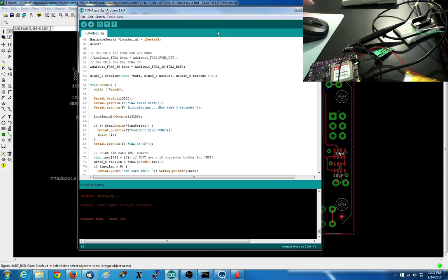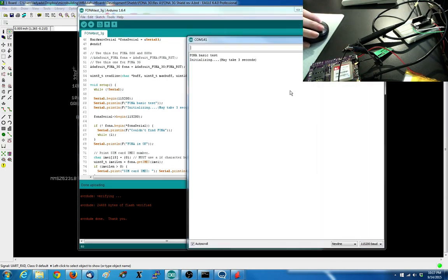The 3G modules use a totally different chipset. The normal phones use this MT6260 chipset, which is a really nice chipset. And yeah, see, so now I'm actually getting replies. Yay! You can see it's saying AT received, AT response, ATE 0 send, AT 0 response.